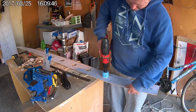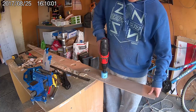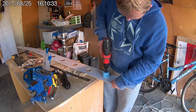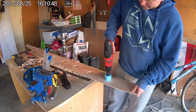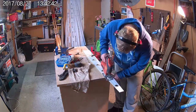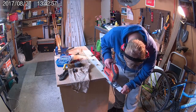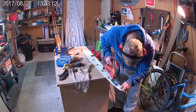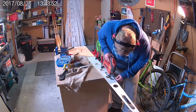This process can be tedious and time consuming, however it's worth continuing as it will give you a much lighter board. Once you have finished drilling all of these holes, you can then finish cutting out the weight reduction slots using a jigsaw. If using our full sized templates, all of the cut lines will be pre-marked on the templates. Simply cut along the lines between the holes.